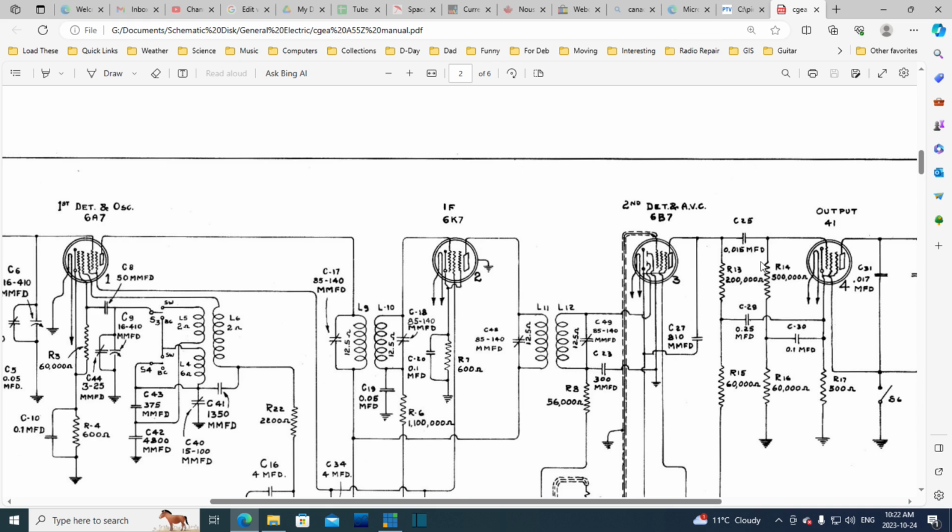This capacitor, well, that's interesting, a 0.015, and I found a 0.02 in here, because I changed this capacitor. This is the one I've changed already. Did I make a mistake? 0.02, 0.015, not a lot of difference there. But that's quite a specific size. So the size of this capacitor is going to affect the audio coming out of the speaker. I would say make this bigger, get more bass. So if anything, I boosted the bass here by putting in a slightly larger capacitor.